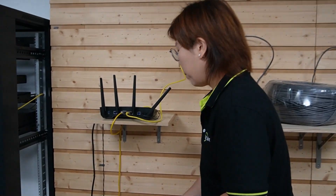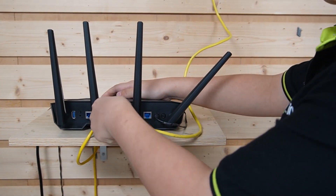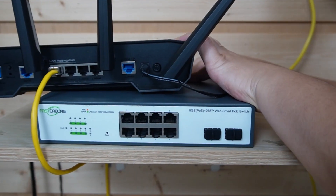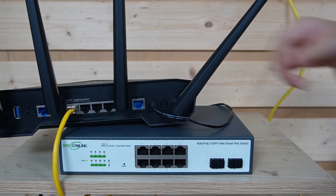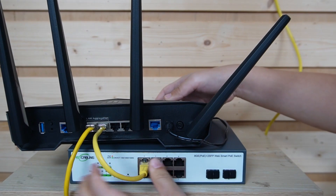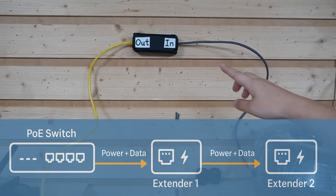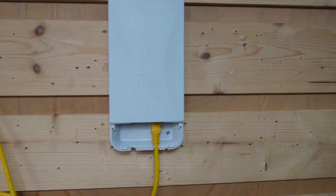In order to fix this, we are going to add a PoE switch here with the router. Let me unplug the cable and place our PoE switch here. We are going to power it up — I'm going to plug in our AC cable. I'm going to use a short patch cord to connect the router to our switch for data, and then connect another short patch cord from our PoE switch to inject both power and data to our first extender. And that powers both extenders down the chain. Now we are seeing the indicator lights coming on.